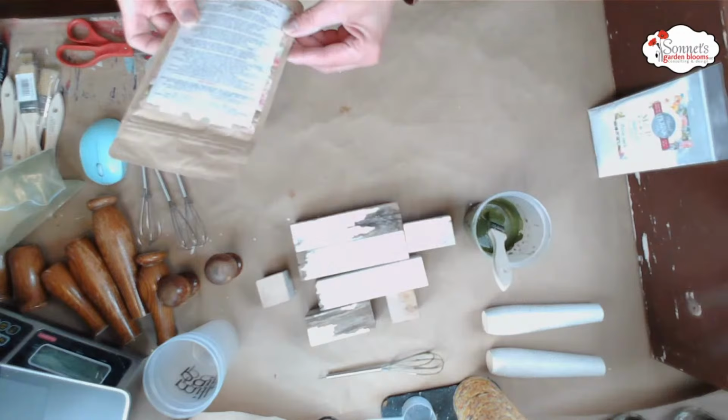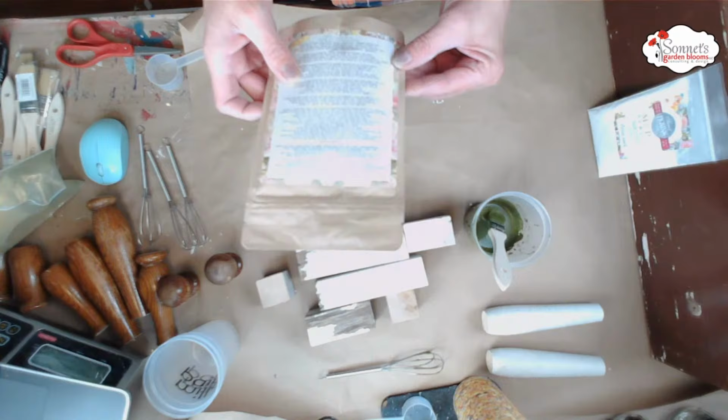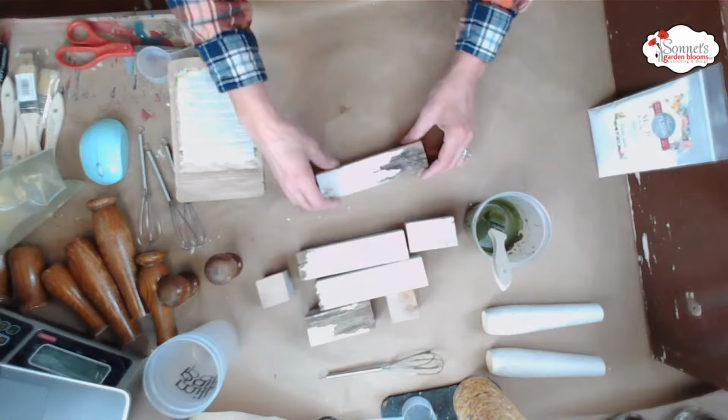Do not mix your entire bag of paint all at once. Generally, milk paint will not store well. Once mixed with water, it begins to spoil and some colors will gel up within hours of mixing. It's best to mix up small batches at a time and not try to store leftover paint. So, all right, guys, let's start.